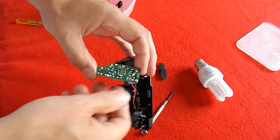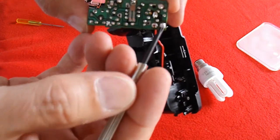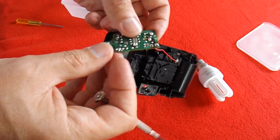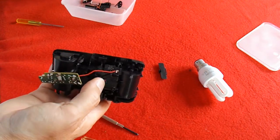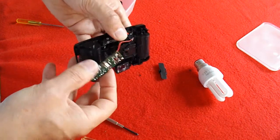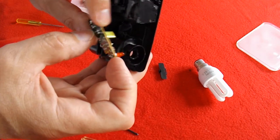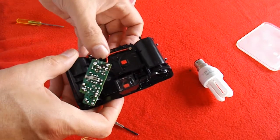As I understand it, those two terminals are the ones that had the capacitor on them — I'll just come in a bit closer, those two. So that should be where I connect my light. That was the switch that previously operated the flash. On the video the guy actually solders that down, so I might do that in a minute. If I just stick a battery in there, what should happen when I press that button is that little red light should come on. And I've got a little bit of a belt at the same time. So the next thing to do is connect the light up to those terminals.